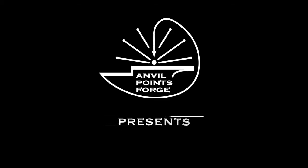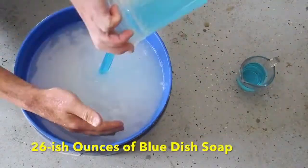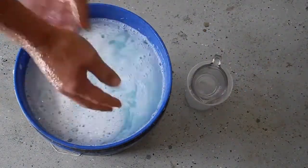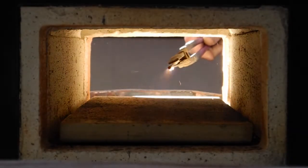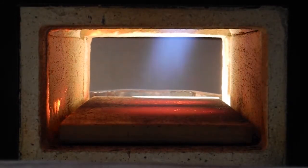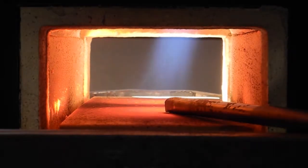Hello, welcome back. This week's video we're gonna make a center punch using mild steel, which is not a very good tool steel. But in the last video you saw me make super quench, and its job is to make mild steel suitably hard. It doesn't replace tool steel or high carbon steel, but it is a lot cheaper and good enough.